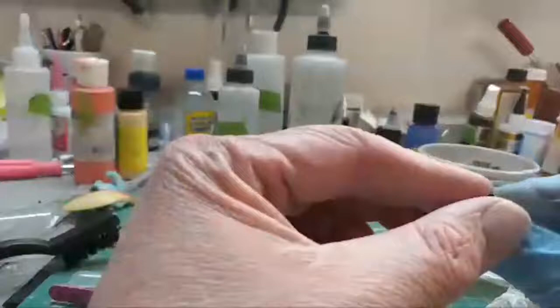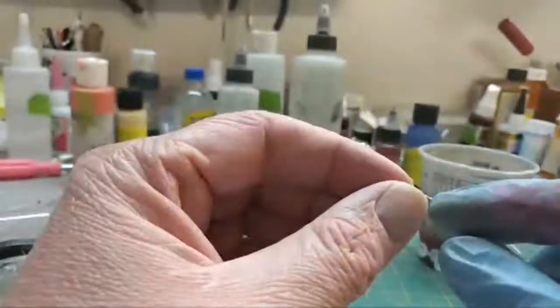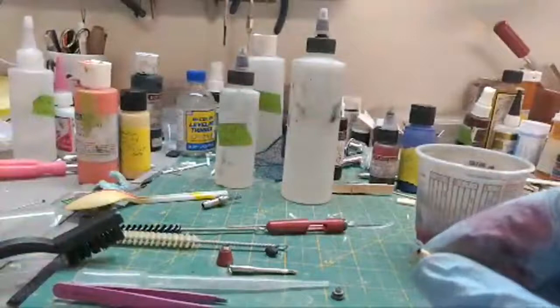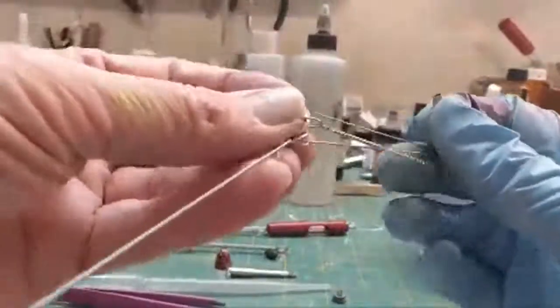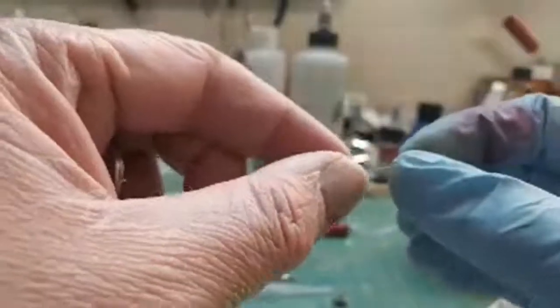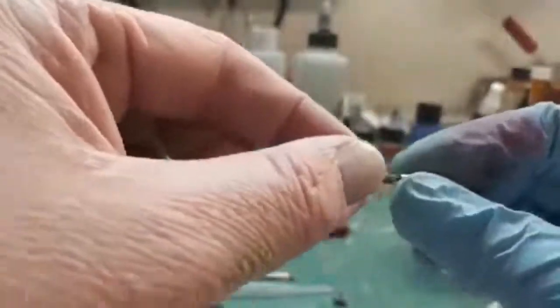And if you just squint your eye and pull that up to your eye real good, you'll see if that's nice and clean or not. So I said, I very rarely take this apart because of the fine threads on it. If it's really clogged up is the only time I really work on that to take it apart. Then if this is real bad, I just take the finest one of this wire. Then I make sure, don't force it up in there, and kind of spool it around a little bit. Because that soft brass, you'll scratch it.